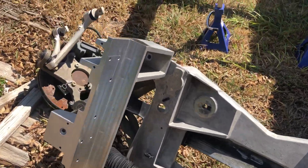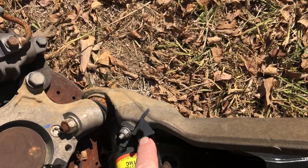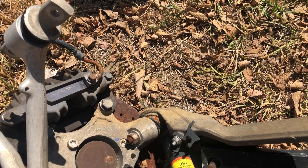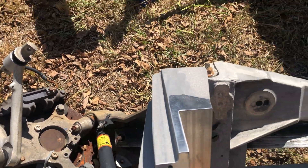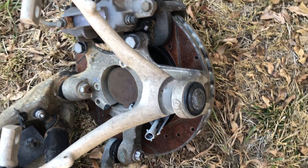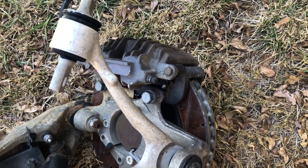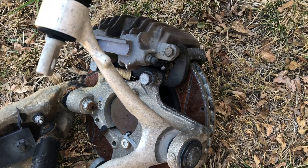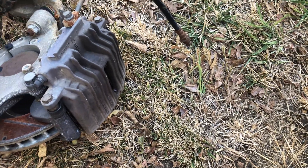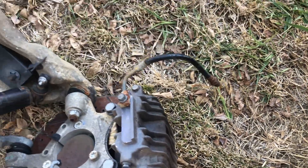You can see what this looked like before any of the acid — that red-brown-tan color — and again, just soaking it for a minute or so with that cleaner makes it look like the other cleaned one. This is one of the few pieces that did come looking pretty decent from the car wash and the other cleaners. But there's a night-and-day difference; this one will come out looking like brand new once I apply that. The brake calipers really looked bad, and again that aluminum cleaner brightened them up significantly.